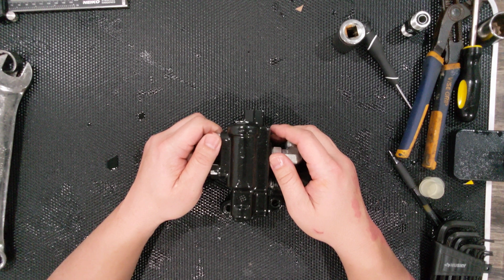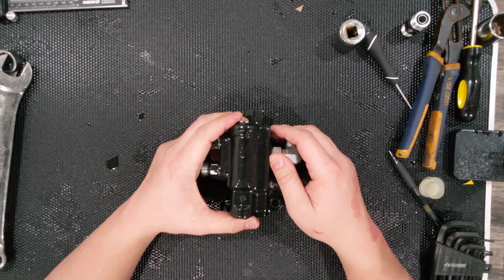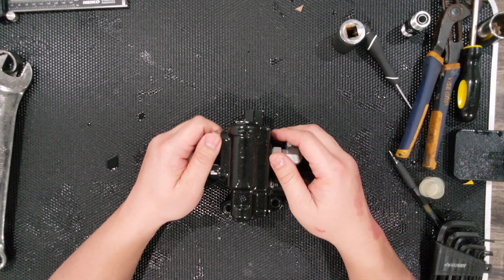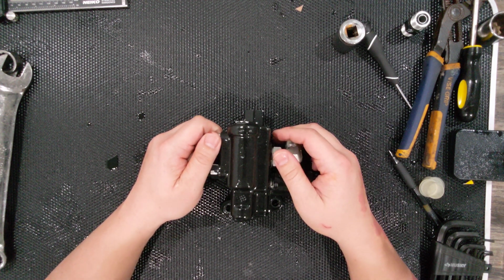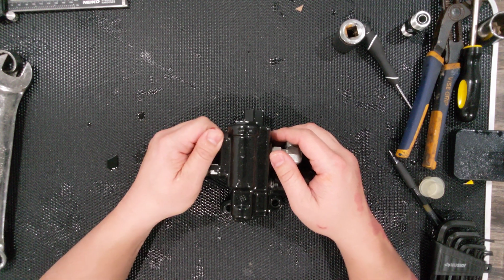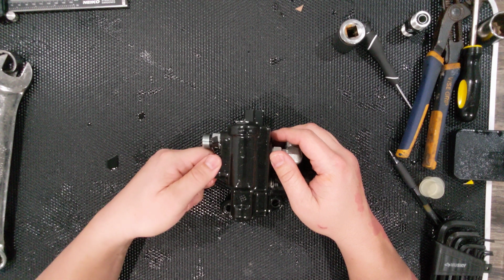They're probably using a similar system to John Deere. The exception is for them, I think they're using a priority flow divider, which means it has to satisfy the fluid to the steering circuit before it gets any fluid to the implement circuit. That's why I think I've heard people recommend not running it at the lower level. I don't think that's going to hurt anything because the pump always has fluid. You're just not going to see any fluid flowing through that implement circuit unless you have enough RPM.